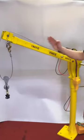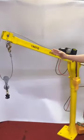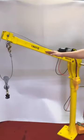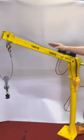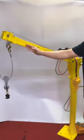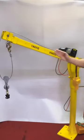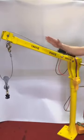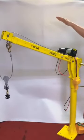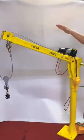As you can see, the beam is telescopic. We have three positions here: this one is 500 kg, this one is 250 kg, and this one, which is the longest, is 100 kg. The reach maximum can be 1.5 meters and the height maximum is about 2 meters.